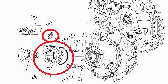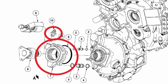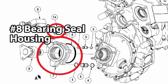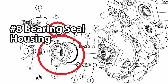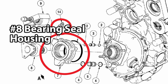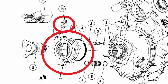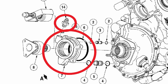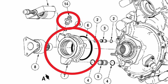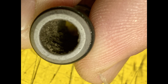Here's a quick review from the maintenance manual of the engine. This is the front bearing seal housing for the number eight bearing on the PW206B2, and the P3 fitting that goes on the side of it. Inside there it fills up with a lot of garbage — all the dust that flies into your engine goes into your P3. If you're landing in fields, a lot of cut grass in summer or spring goes into the intake, gets chopped up into dust, and goes into your P3.